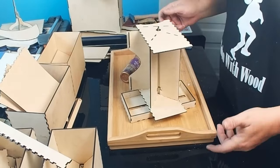I went through a couple variations of cams. I went with a shuriken, kind of like a Japanese throwing star. The problem with that, and the problem with this, is they're directional. They'd only work one way. So it would work fine when you rotated it this way. If you tried to come back this way, it would actually grab in that pencil and it would lock up. And I could see an 11th or 12th grader saying, you know what, I'm getting dead, and he breaks it and tears it up. So I redesigned it to have a bi-directional cam there.